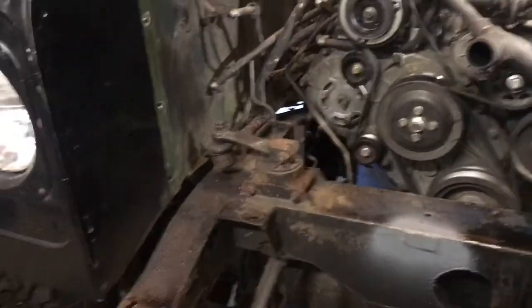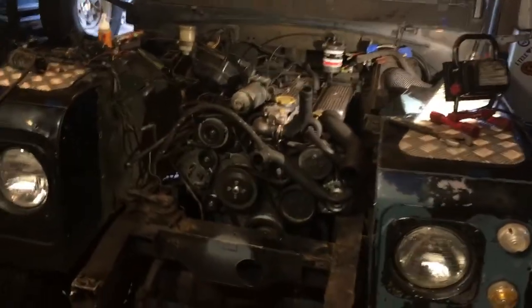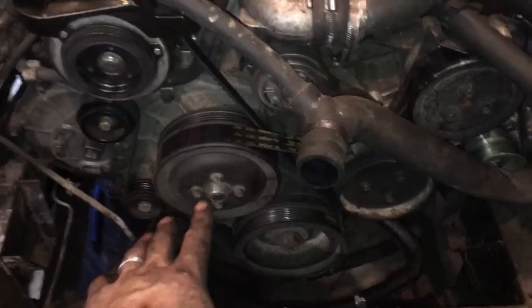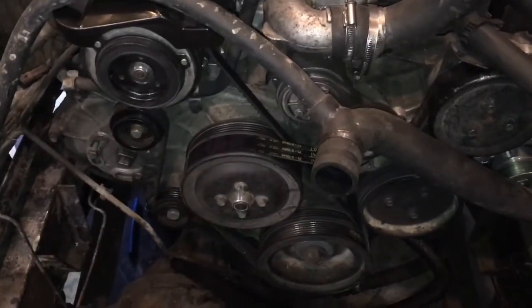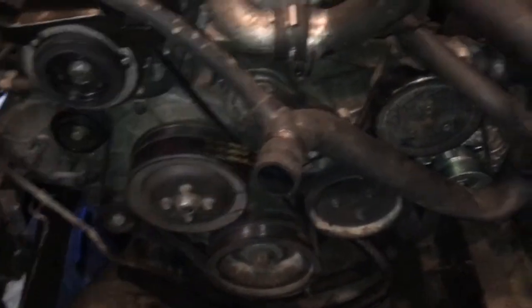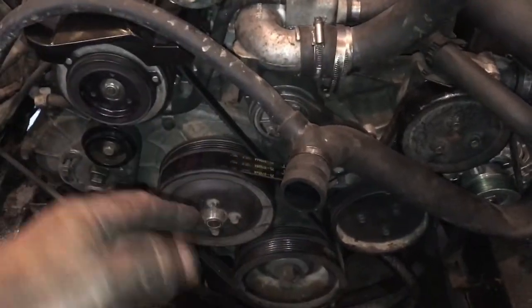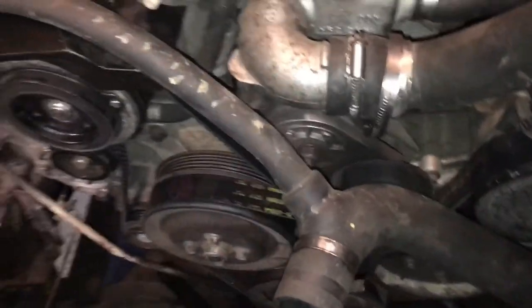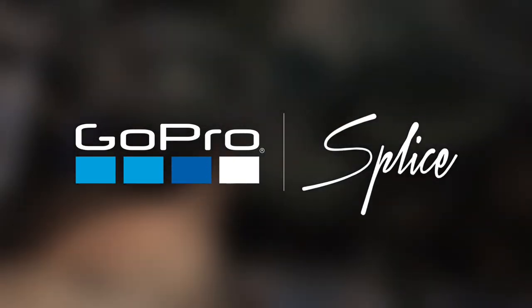Thanks for watching and I hope this has been helpful. We're going to take this truck a lot further, get it running, and cover all the electrics and everything like that, but we can leave it here for the weekend and have some family time. One last thing — we had to remove the viscous fan to have enough room to do this. With the clutch and everything in the way we had nowhere near as much room, and doing it by myself made it harder. When you set it in with the flywheel housing on the back and the clutch, you don't have the ability to get it in with the fan on very easily. You'll have a very close tolerance to watch out for, so we recommend taking it off.